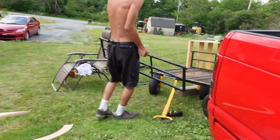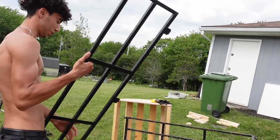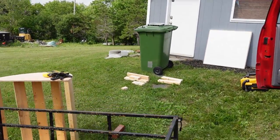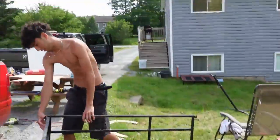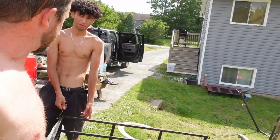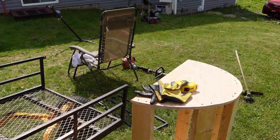I said it's not a very good idea to make it out of wood because that's going to burn. You don't think it'll last very long? No man, trust me. Yeah, you're probably right — let's probably make this out of brick or metal. Well, see, I'm making it out of brick. But in order to make the arch for the oven you need something to support the brick until it dries, and that's what the wood's for. The wood is to support it until it dries and then you take the wood out.